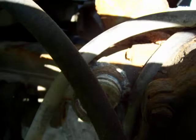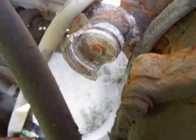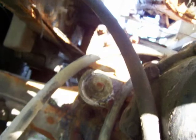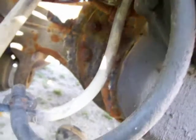Oh, I forgot. I noticed this. Oh man, that's a bummer. I'll have to dig around and see if I can come up with that. That's on your interaxle locking mechanism. This is the other end of it. Oh man, that's gonna be fun getting that thing off, because that's right at the base of the hopper bed, so all that urea and fertilizer ends up here. It's a mess. I'm guessing that's what caused it. It's all busted up. I hope I can find one of those. I almost forgot that. Truck works fine without it. You just can't lock your two rear ends together. I think they've run it a while like that.